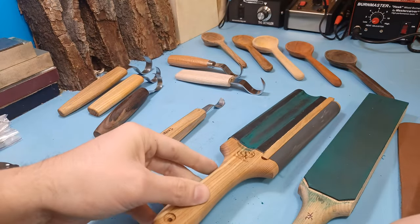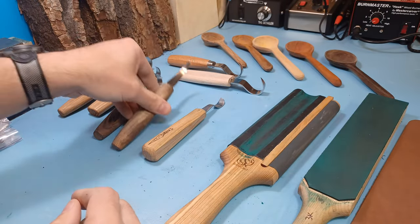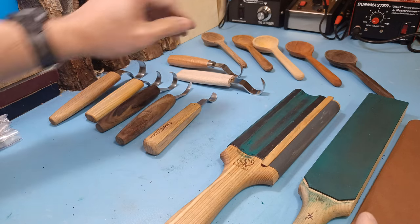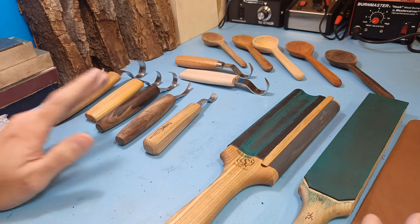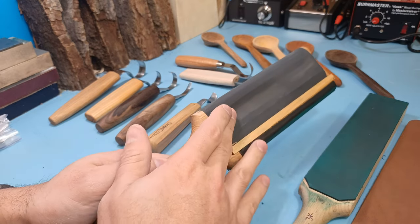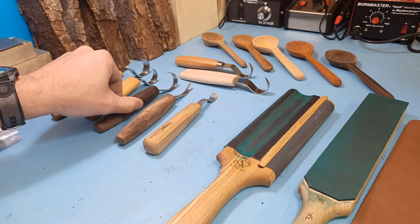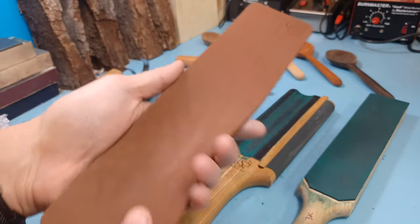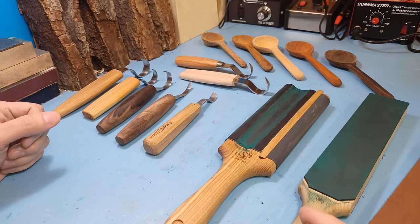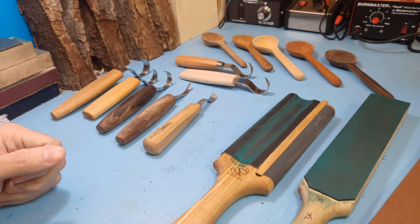You can also use a loose leather strop and just work it with your hand like that as well. Personally, if you have the ability, get a decent hook knife to begin with. The cheaper ones on Amazon are too cheap and you'll have to put a lot of work into them. If you do get one of the super cheap ones, I highly recommend getting the Beavercraft tool as well, since you'll need to refine that edge more. But if you have a regular hook knife and don't want any power tools, just get a regular loose leather strop with compound, or the Beavercraft strop. That's essentially all I do — all my work is done on the outside edge. Thanks for watching.